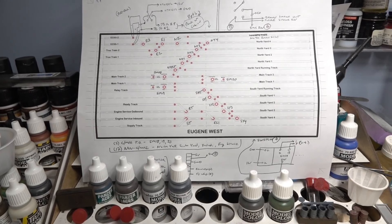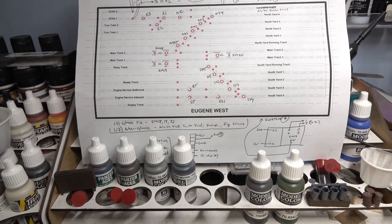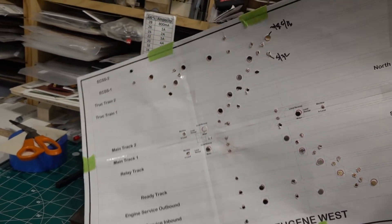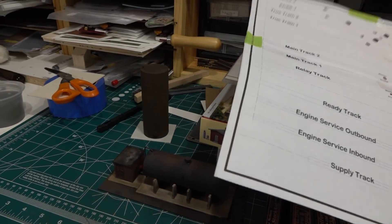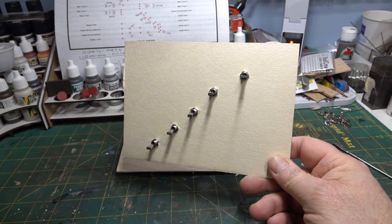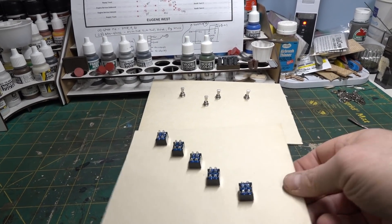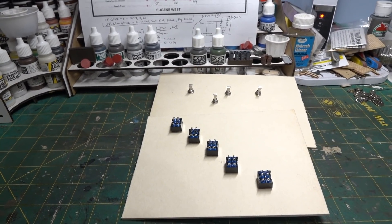The problem is trying to put five tiny toggles upside down, support them, and solder them - how do you do that? Well, I have the drilling diagram I used to drill holes in the actual cabinet. I had some extra taskboard laying around, used that same template, quickly drilled some holes, and now the switches sit in there in the exact pattern they'll be in the cabinet.